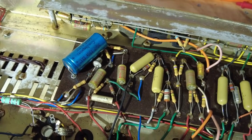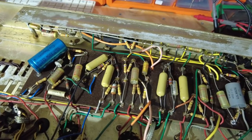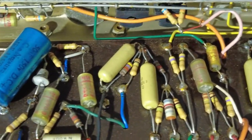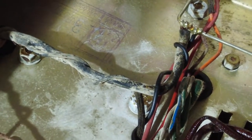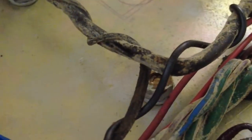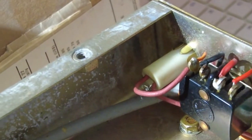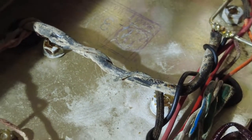I've already done a bit of testing on some of these caps and we've decided we're going to recap this amplifier completely. There are quite a few leaky caps that we've tested, so we're just going to recap it all. Also, if we look over here we can see that at some time it looks like either something's been spilt in here, or something's let go — it does look like electrolyte all over the cables and up on the sides of the chassis.